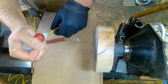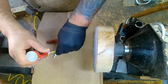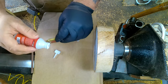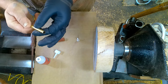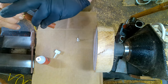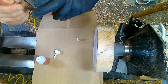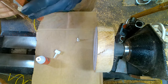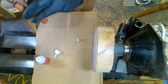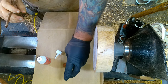I'm going to get our glue. It might be too thick — might have to go to medium. There we go. When you glue a pen barrel in, put it in one end and spin it and take it to the other end — that gives you the most full coverage. If you have some kind of a little pushing tool, get your barrel centered where you want it. I'm going to try to get it as close to that end without leaving any of that crack, so I can sand away this white part and have less carving to do. That'll do it.